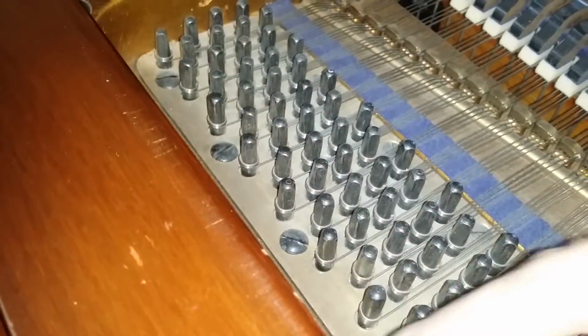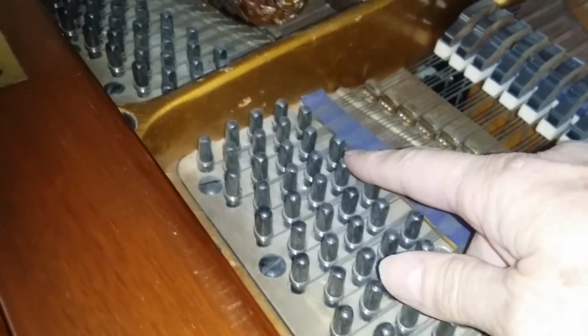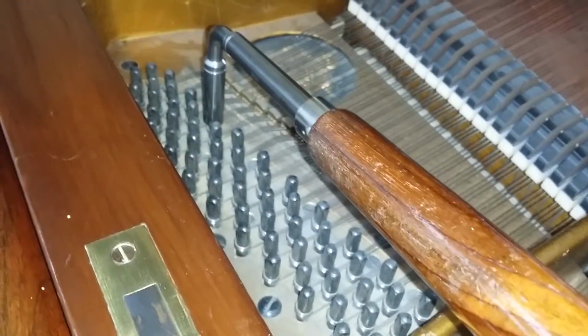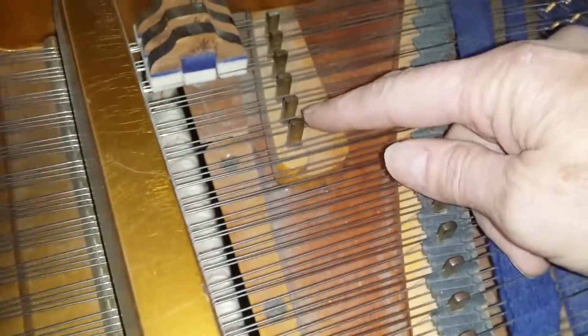Now, it's got the original Bluthner tuning block, the pinblock, underneath here, but the tuning pins are very tight. They've restrung it and repinned with larger pins, and they're very tight pins, so there's no need for a new pinblock, really. Our Style 6 is aliquot scaling. That's the extra string here.